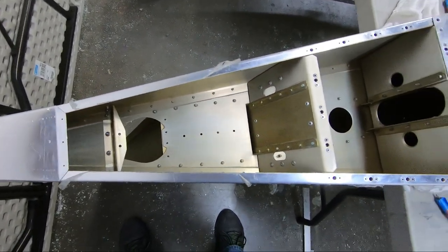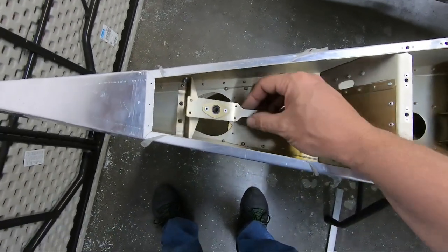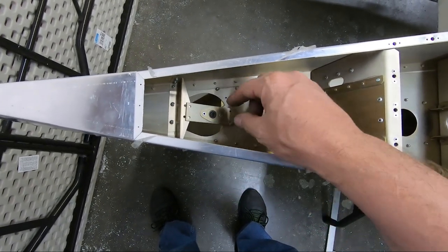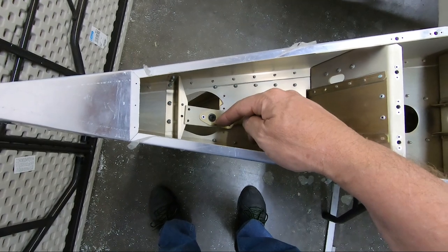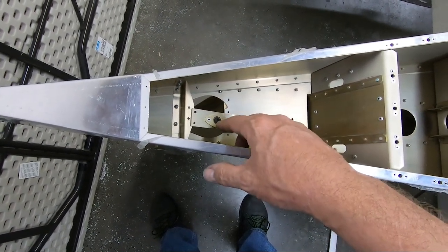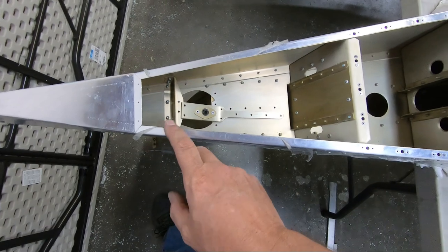I don't know that I want to put screws in there either, but I've got to figure out how this was intended to work. Because I put a bearing on the bottom, I now have a nut on there — the original plans were just supposed to have a hole inside this fitting, and the rudder would pull out of the top because there was no bearing and no nut required. Now that I have a nut, I probably do need access to this from the bottom in order to unbolt and get the rudder out and also to lubricate this bearing. So I have a different situation than what's actually in the plans — I will have to make this cover removable.